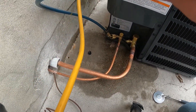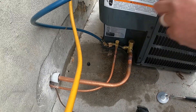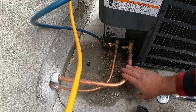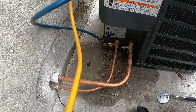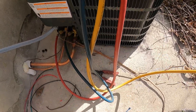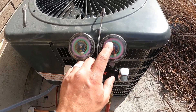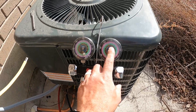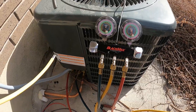That's pretty much it for this part. I have to braze in the other side, so I'm going to do that and then we'll jump to how to pressurize the system and make sure we have zero leaks. Here we are — we've had our nitrogen on for about 30 minutes now at 350 PSI and it hasn't moved a smidge, so our lines are pressure tested and good to go.